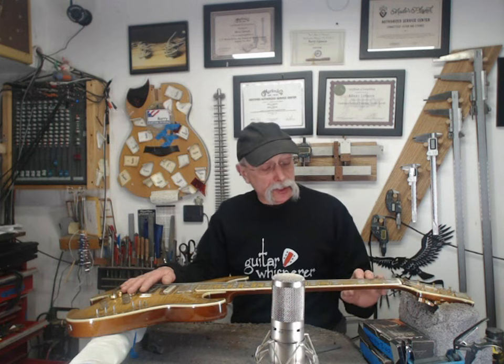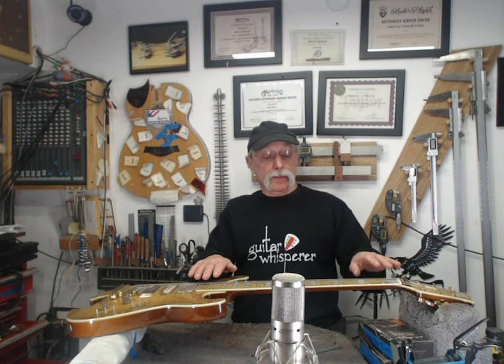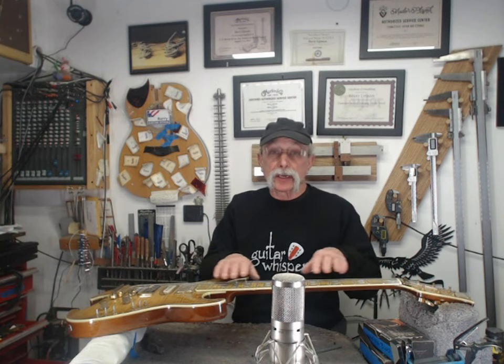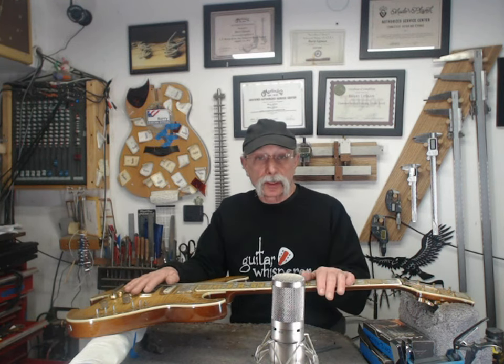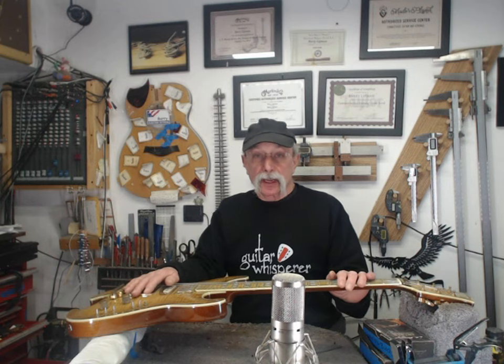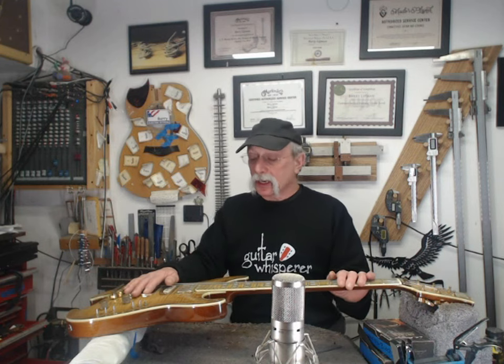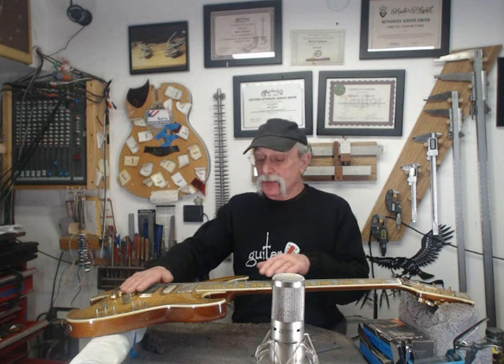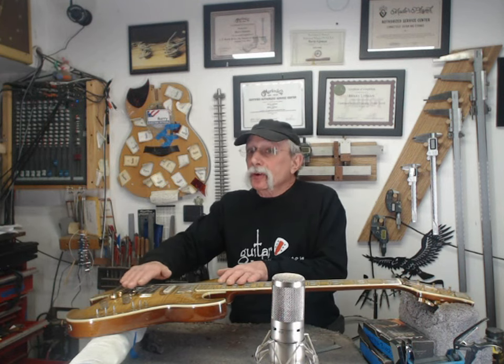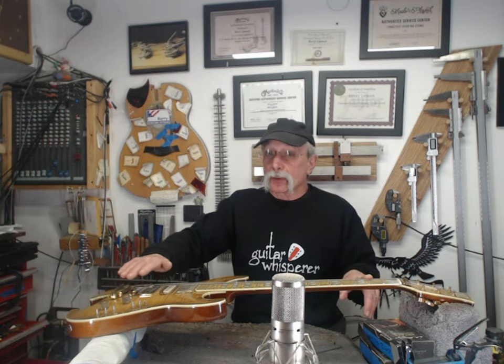If we want to give clearance to the people right behind him, we can raise the stage a little because this is a smaller leg of the lever. So if the fulcrum is here and we raise this here, it's going to come up more than if the fulcrum is here and we raise this the same amount. What if a short person comes into the theater? If a short person sits anywhere, all he's going to do is block himself — nobody ahead of him or behind him is even going to notice — but he may have trouble seeing. And again, the same rule applies for raising it: if there's a short person up here, we don't have to raise it very much for him to see, but if he's back here, we may have to raise it quite a bit.